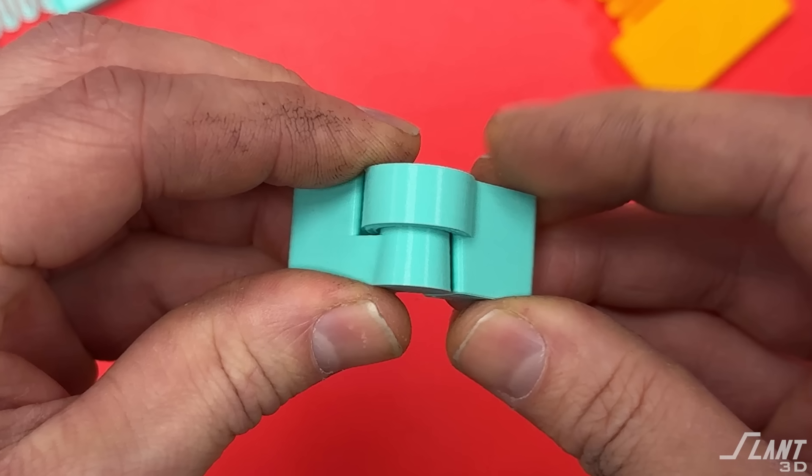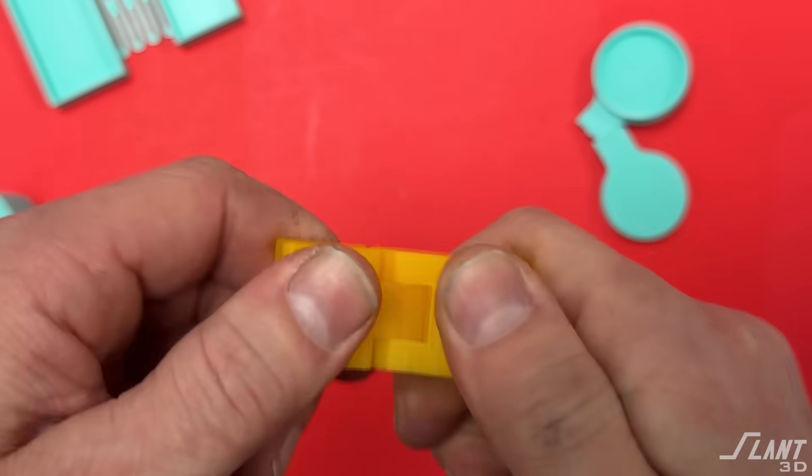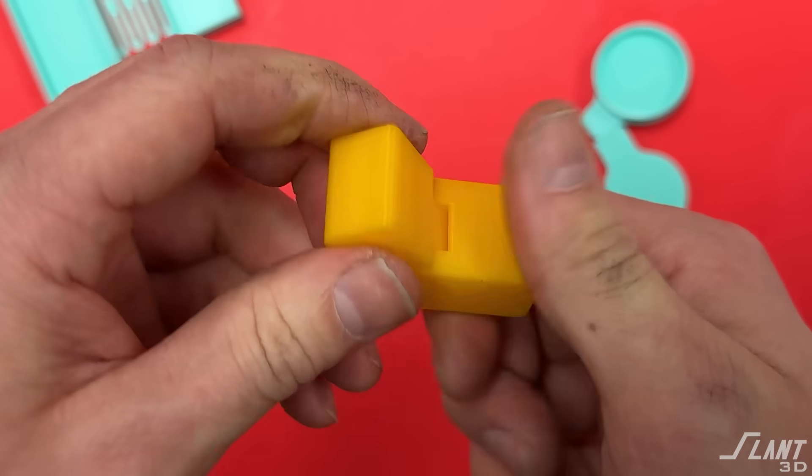There are a few things you can do to readjust around this. One way is basically taking this hinge and making the second half so that you have cone, then back up, then cone again. This way you can create something that doesn't really have the overhangs because everything blends into itself. Even though you have that center spiral it can't break off because you have that baseline chamfered, strong, and reliable. It's a hybrid of the standard cone-top design with a center area and then a bottom.